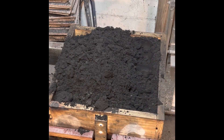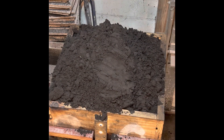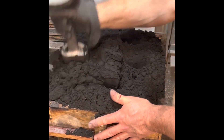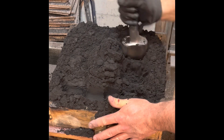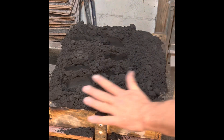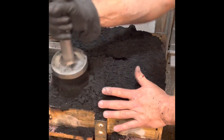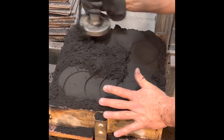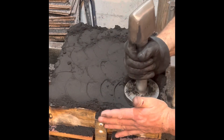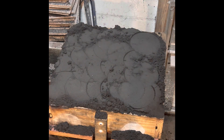Go ahead and add sand until you're good and full. You can go a little high with this. Back to your rammer using the peen. It takes some time and some skill to get how hard to ram — there's technique to it, no way to really teach it, you just kind of have to practice. I added a little bit of sand before I used the butt end to flatten off because there were some spots I knew would be low. Corners are always hard — they're going to be soft.